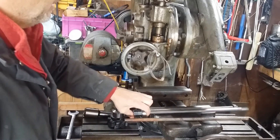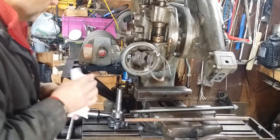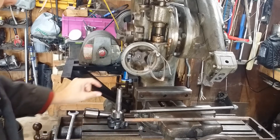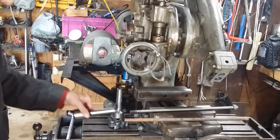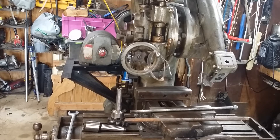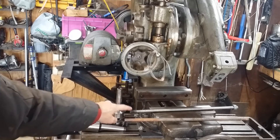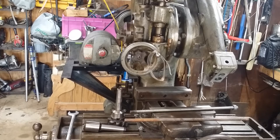I've already tried it on the shell mill holder and it's worked great - it's engaging about three-quarters of an inch worth of thread on the shell mill and on my new collet, so I'm considering that a win. This one holder, for whatever reason, is only engaging about three-eighths of an inch, so for that one I might keep the piece of all-thread around just in case. But that's a seven-eighths inch end mill holder, so I don't know that I'll spend a whole lot of time using it anyway.